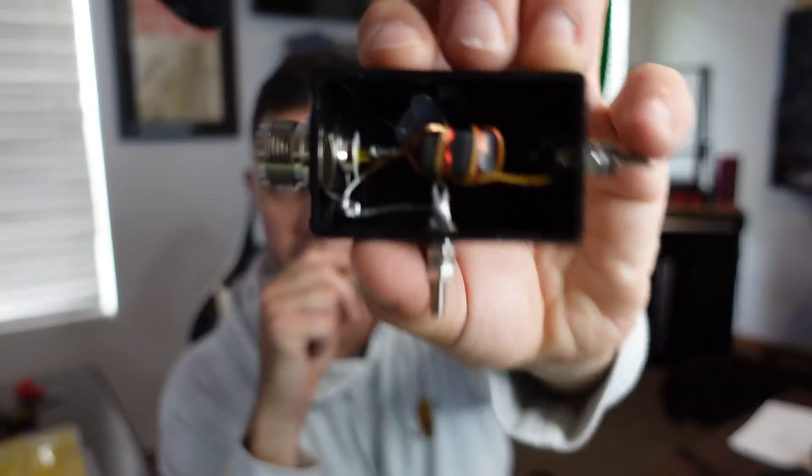After about an hour at 40 watts you'd probably start to see core saturation. This is a very small toroid — there are no magical miracles here. The smaller the toroid, the hotter it gets quicker and the less power you can sustain. If you're just getting into ham radio, looking for your first HF antenna, and have some electronics experience or want to learn, this might actually be good for you — it gets you into the game for $16.